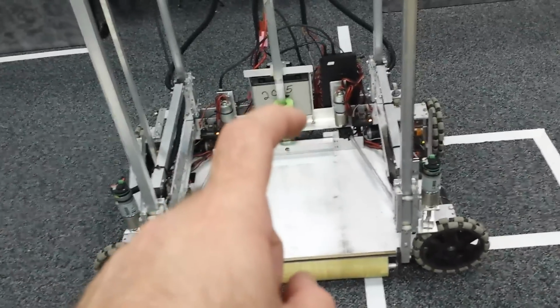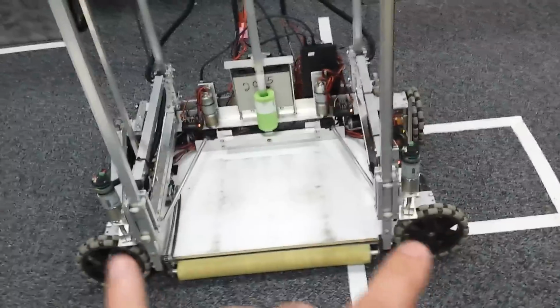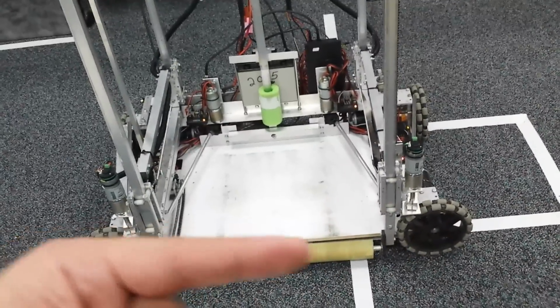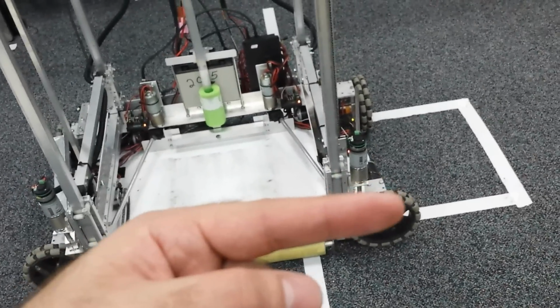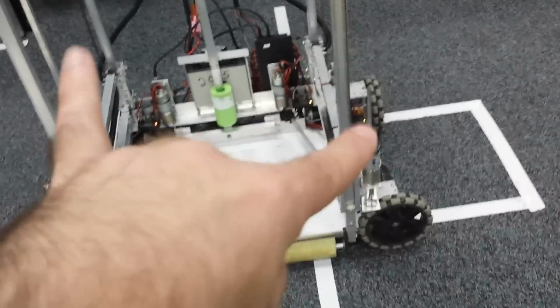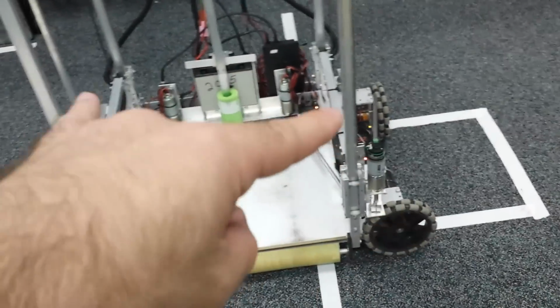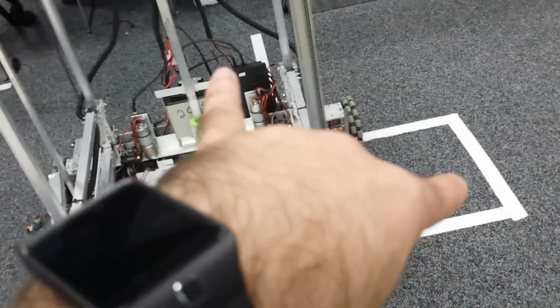We can utilize both. For what we do mainly for teleop is we just have a hard-coded value. So there's a value, a multiplier rather, so when you go sideways, it takes the sideways value, applies a certain factor to it, and applies a rotation to these back 2 wheels. So when you move sideways at full power, these 2 wheels will try to rotate the robot to compensate for it. And same thing the other way.